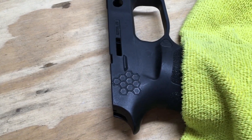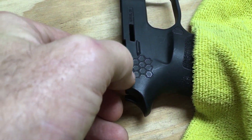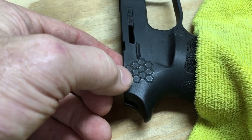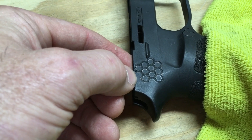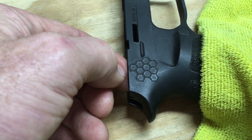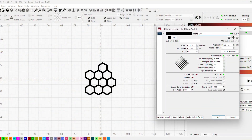Here's what it accomplished with three passes at full power: it's just very light, not very deep at all — it more burned than anything. The deeper I go, the worse that burning is going to get. So let's try another frequency setting and another speed setting.